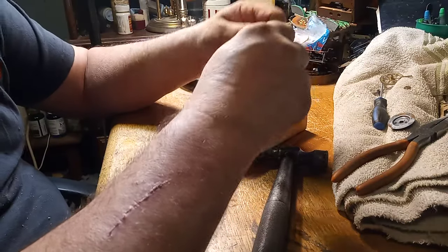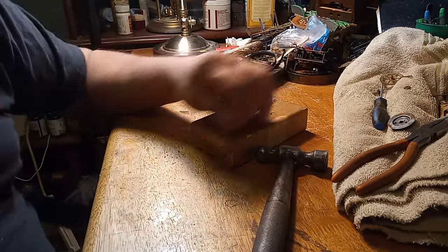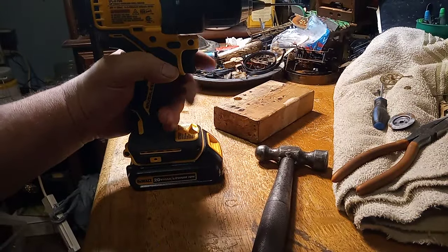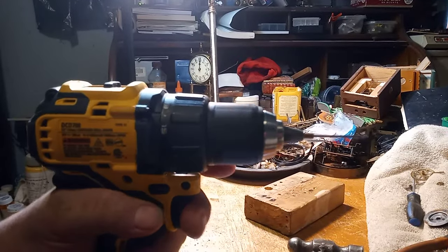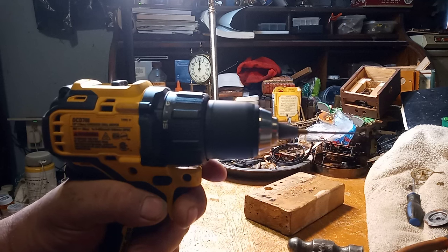Sorry about that — I had my camera stand on the edge of my desk. I'm just going to put it on a block of wood and hit it with a ball-peen hammer as I rotate the arbor, to get the bends out. You can put it in a drill and test it, and as you can see, I got it straight.